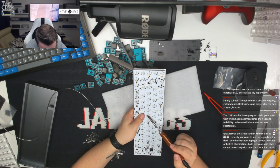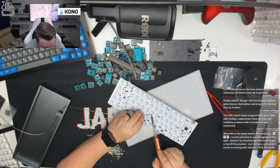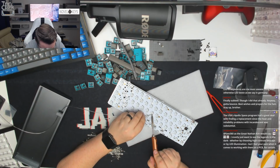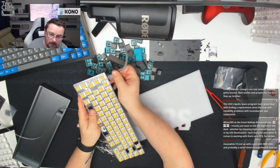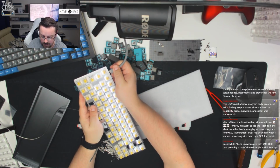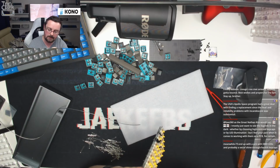That one does not want to go on the pad at all. Let's just see if we can do something a little bit different with this one. There we go. They should all now be nice and neat and tidy, and they are. Let's just give those a try, see if they're all working. Okay, so we've got two on here that aren't working, and the rest of them are, but we've only soldered one leg, so we should be alright. Just going to fix this one on the end. The ones that are working are the ones that have just got pressure on both legs against the sockets.